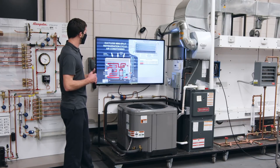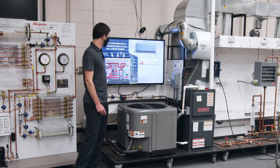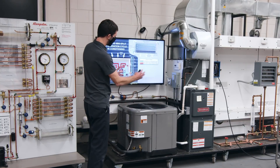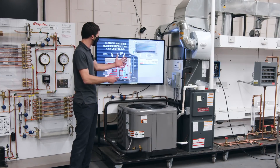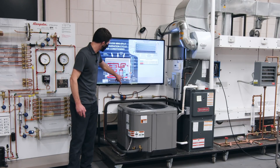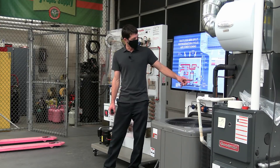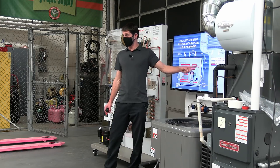A lot of manufacturers don't want us to check subcooling and superheat, and that's why they often don't put a pressure port there — they don't want to confuse you compared to a single or two-speed standard split system. You just have your mini-split that can ramp up or down depending on the heat load. Every time you have a rotary compressor, which is popular on the outdoor mini-split units, you're going to always have an accumulator mounted to the side.